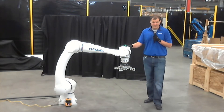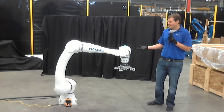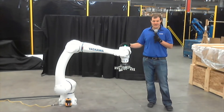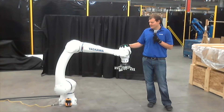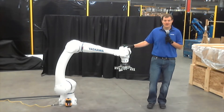The robot has a 1.7 meter reach, which gives it a nice big reach — it's one of the best reaches in class. We have a 0.05 millimeter repeatability on this. This also enables us to reach two full pallets when the robot's on one 54 inch riser, so very excited about the potential pallet testing applications for it.